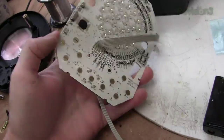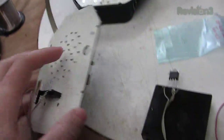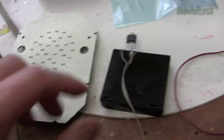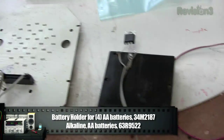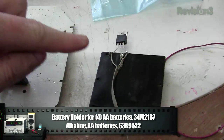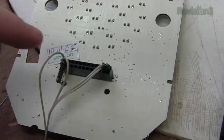This is the slave board. And what we've done is we've just hooked up the data and ground from the master board to drive it. And I have a little battery pack here, and I did this really cheapy. Battery pack will give us 6 volts. The 6 volts there will go into the 5 volt test here. It should be close enough.